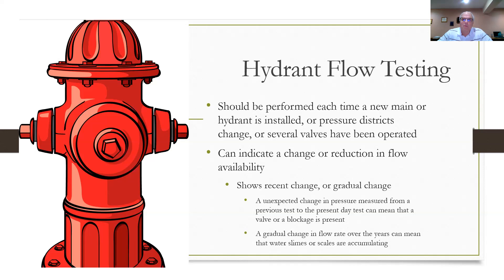The other kind of change you might see would be a slow, gradual change. If you do fire flow testing at a given hydrant over the years and keep records, and each year you go back and see that the flow capability of that hydrant has lowered by a few gallons per minute, and slowly over time you're just not able to get out the amount of water you used to get five or ten years earlier — that might be an indication that you're growing some slimes in the system, or that you've had some tuberculation due to a very aggressive water, and that you might need to flush a little bit more aggressively.